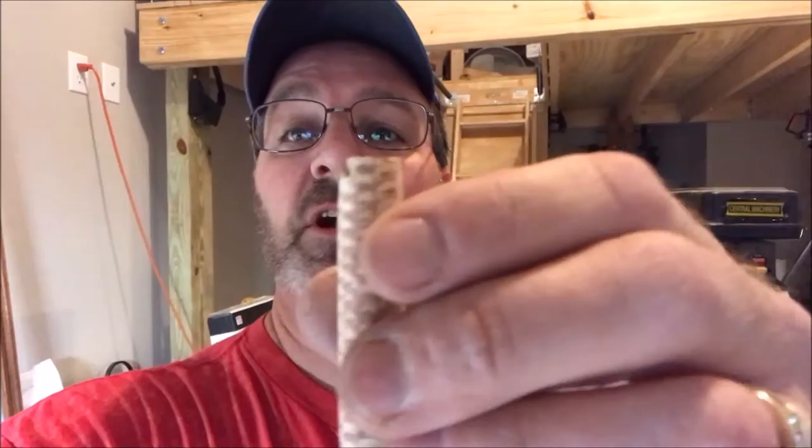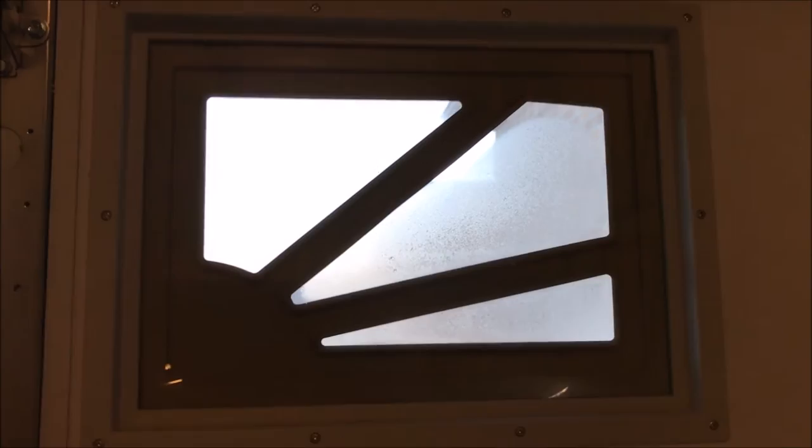Wow, that was a lot of work. I had three corncobs long enough to become Stratus pens. The first one had a little blowout while drilling for the 3/8-inch tube, so that one didn't work out. The second one I was able to drill and glue, but I had a little blowout on the end while turning — kind of a bummer. The third one I was able to turn, finish, and polish, and it's ready to be assembled. I think the kerosene heater put some moisture in the air — you can see moisture on the inside of the windows. The thin CA was drying in about twice as long as normal, maybe two to two-and-a-half minutes instead of one, which is extremely acceptable.